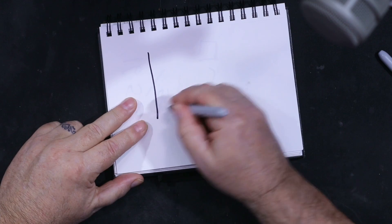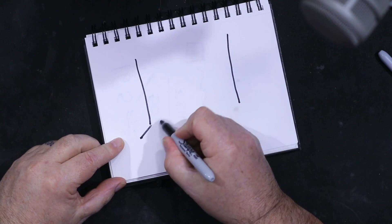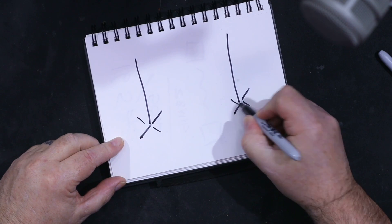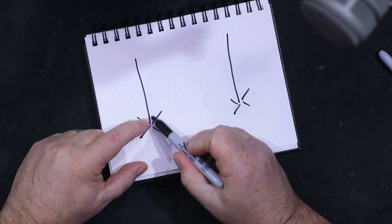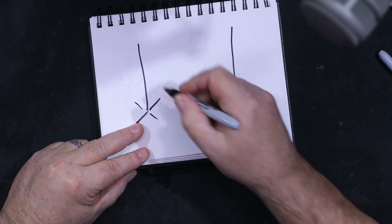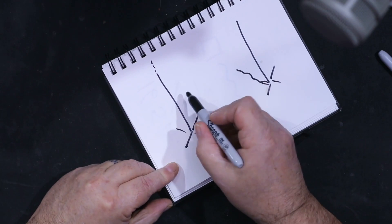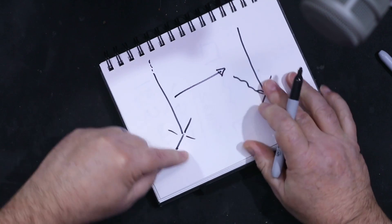As a reminder, to play with this, you can build two verticals. You can just ground one — literally ground it, no coax at all — and put the coax to the other one. You can make that one a little bit longer, effectively. You can make it the same length; it's just not going to be as efficient. But to start with, you can do it this way, and then that becomes like the back of a Yagi — your signal goes that way.